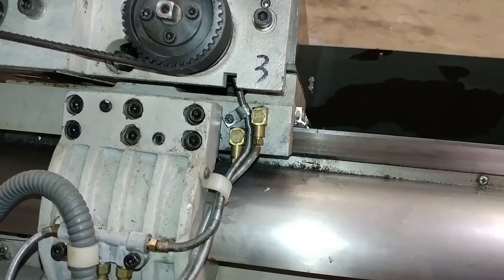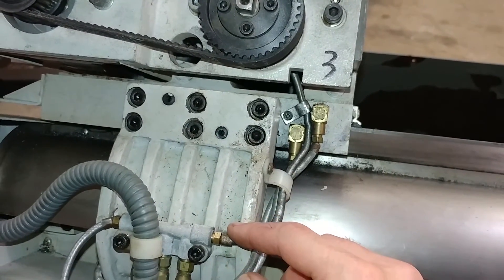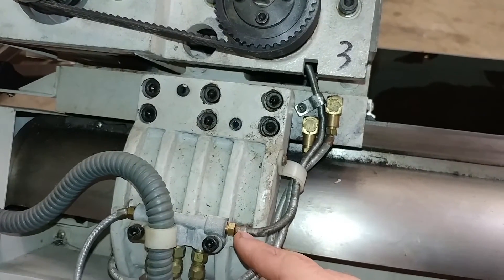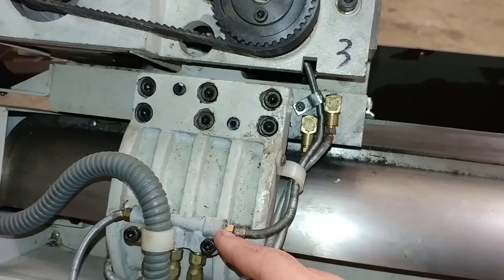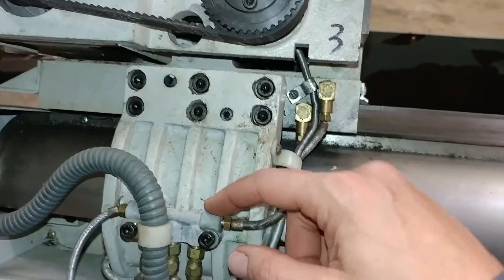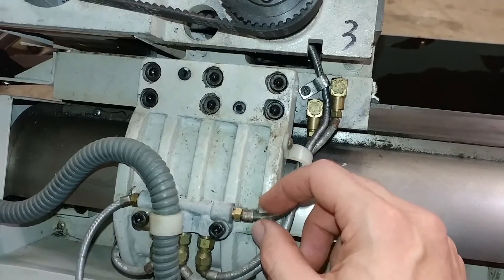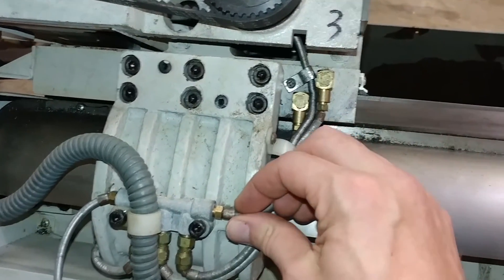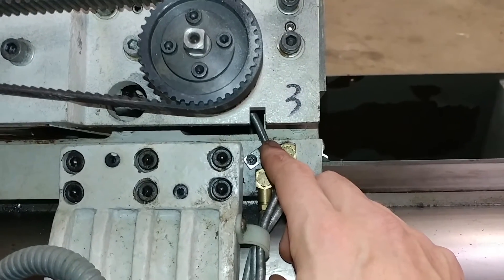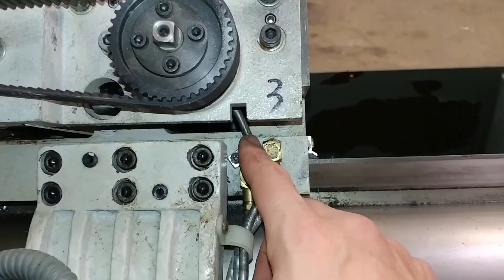So, notes after taking this off and rerouting it, tapping the hole for this screw, and putting it all back together. When you take this connector out — this was a used machine, so I think this would have been assembled by the previous guy — it wasn't all the way pushed in. There's a little brass fitting on the end of the hose that's inside this sheath, and it stayed stuck in the hole. I had to pull that out with a pick. Just make sure you get that out and then get it seated over the end of the line on the inside, otherwise the line is loose and it won't stay in there. My hose, I think because it's been on here for a while, wanted to go in a certain direction in order to hit the hole, rather than being more horizontal as intended. I think that's going to be OK.